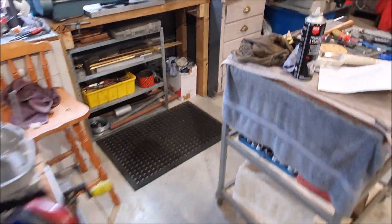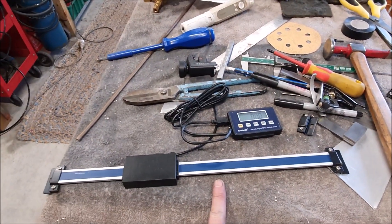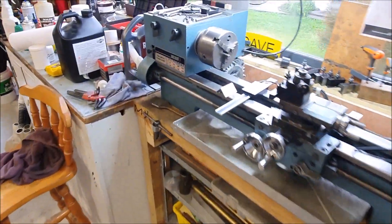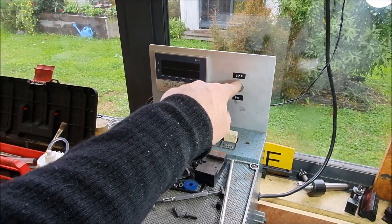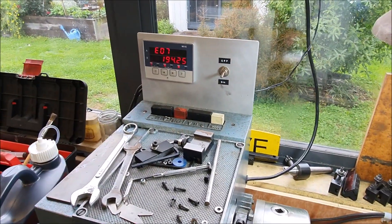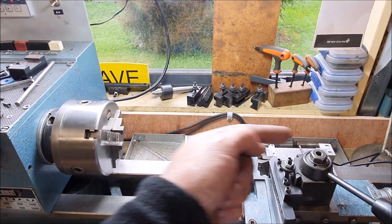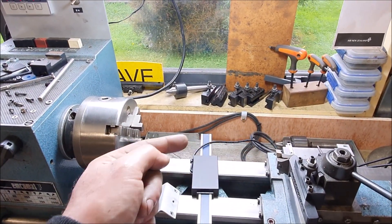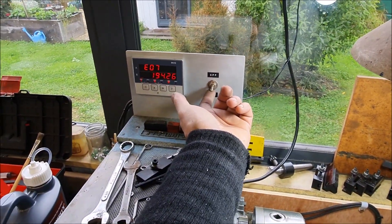In order to do that I was working on the lathe, and I decided it was about time I fixed my DRO on it. If you've seen any of the other films, you'll know I got one of these magnetic DRO units. I put that on and this axis works reasonably well, but I could never get the cross slide axis to work properly — it just would skip measurements.